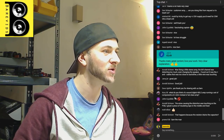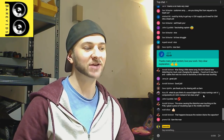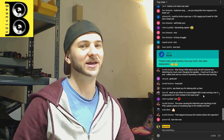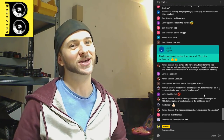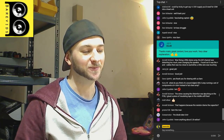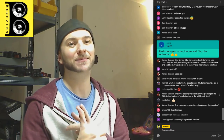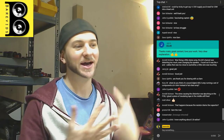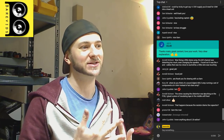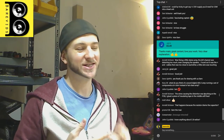What do you think of a Sound Digital 400.2 amp running a set of components at 4 ohm instead of a Class AB amp? So Class D mid-range amplifiers generally are quite noisy. Most car amplifiers are pretty low quality anyway. You'll know that if you watched my video about cheap amplifiers killing subs that I responded to the guy from EMF Audio. I explained there that car audio amplifiers are some of the worst designed electronics on the market when compared to PA amplifiers, home cinema, home hi-fi amplifiers, Bluetooth, even Bluetooth speakers are generally better designed than car amplifier circuits. So a Class D full range amplifier circuit will pretty much have a high noise floor.